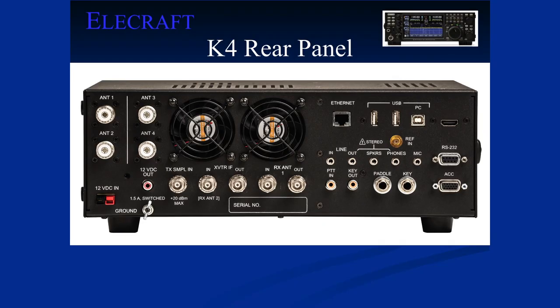There's a big Ethernet jack on the back. We can remote-control the radio over that, stream audio over that, and I'll talk about that remote control capability in a minute. You can also do all the command interface, and we can stream IQ data for external programs like N1MM that want to display their own pan adapter on their screen.